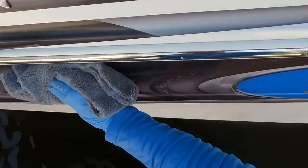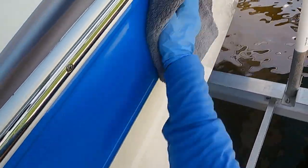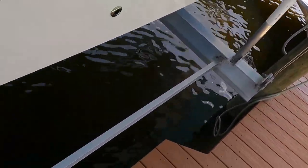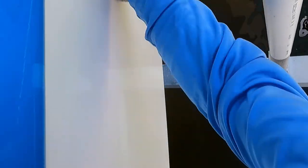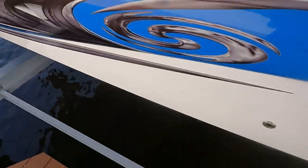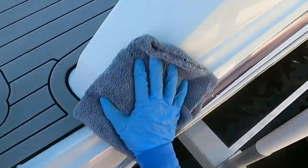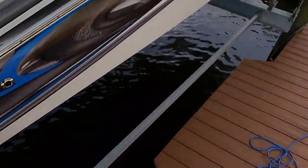We made it. Now, how long did I let the polymer sit? In my situation with a canopy above me, it's about 90 degrees, pretty hot and humid. But since we have shade — and shade becomes the biggest factor, followed by heat — we were able to wait 30 minutes. We also had a really well-conditioned boat with no slight oxidation. So the heat, the sun, and how much oxidation is in the boat all factor into how long you can wait to wipe this off. A perfectly conditioned or brand-new boat gives you as much time as you need; with a little oxidation, some age, heat, or sunlight, things change. We waited 30 minutes per side — by the time I'm finished applying one side, it's time to come back and wipe off.